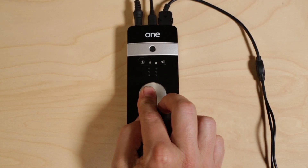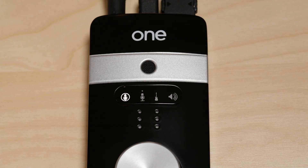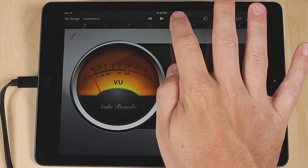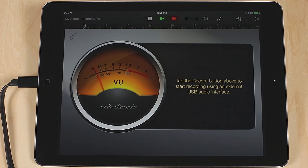One can control input and output level with a single knob. The four icons on the top panel indicate which input or output source you have selected. We have Internal Mic selected, so you will see the Internal Mic icon is lit. Plug in your headphones or powered speakers, adjust your levels, press Record in GarageBand's Transport Control, and begin recording.